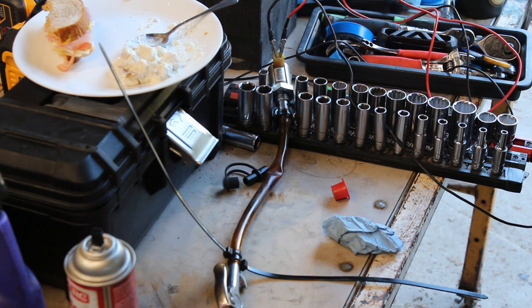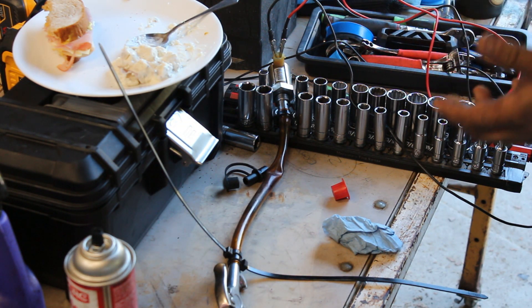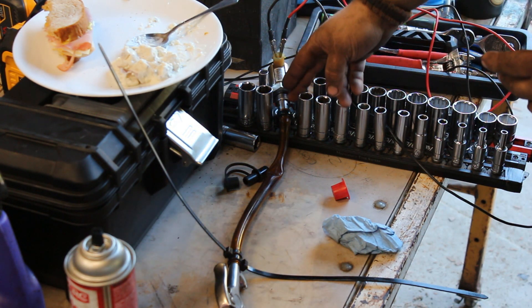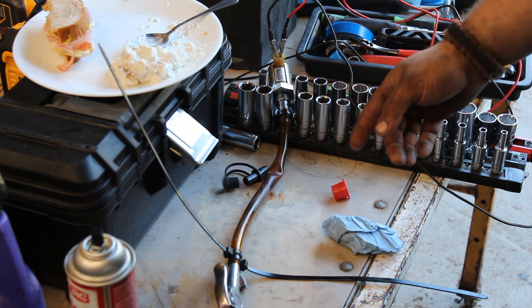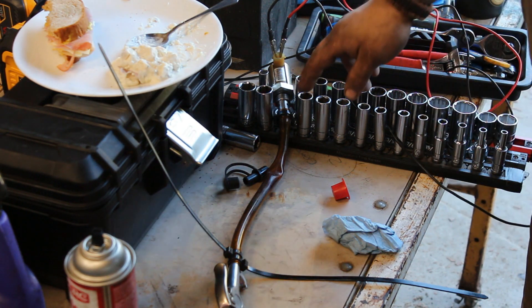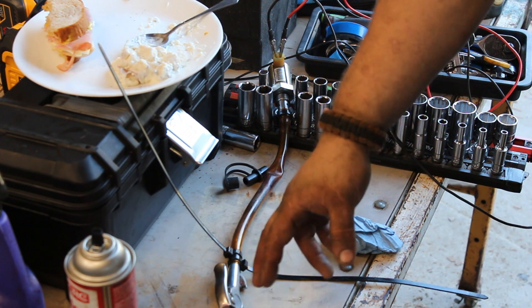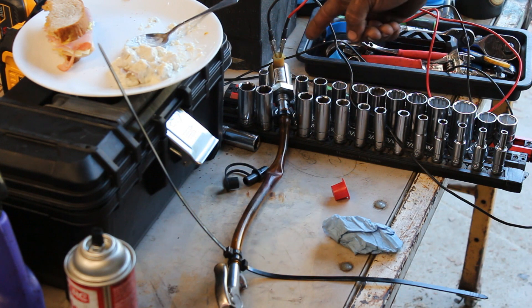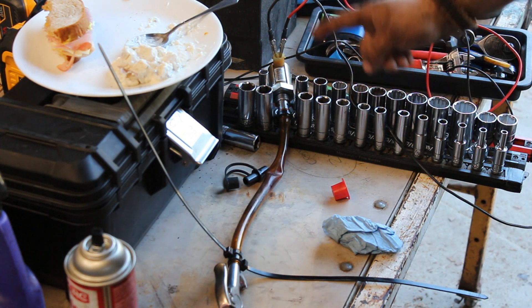Apply a little bit of air. I was applying power to the IPR on and off several times as air went through the tube. When a solenoid actuates you can typically hear it — in this case you can actually see the coil move inside the sheath. You should be able to see it and hear it. With the air, you can hear it shut off on the solenoid end. Once it is energized it should shut. This one does not — this is a bad IPR.